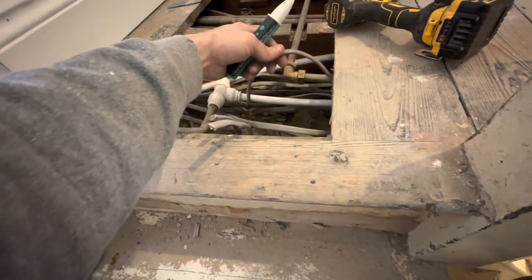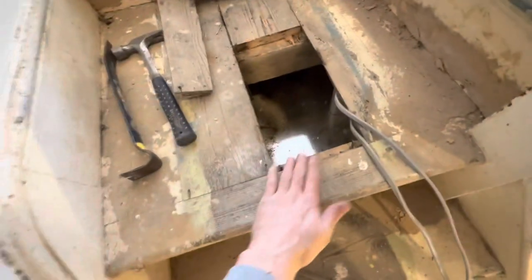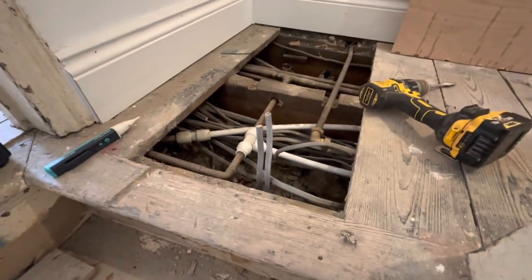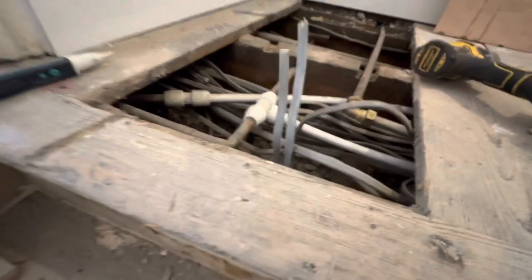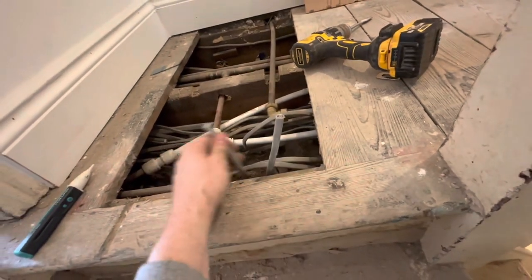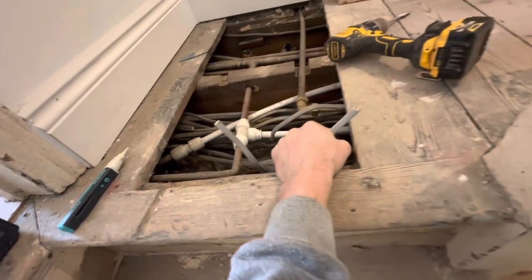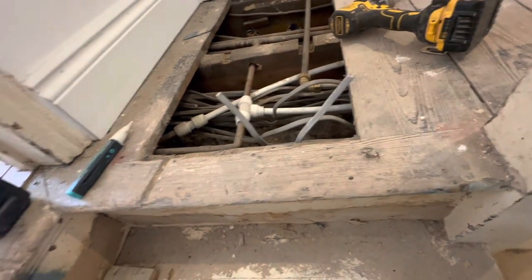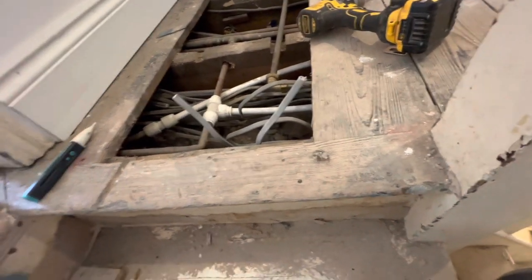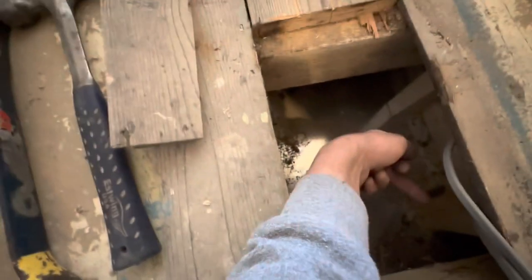That one's live — that is the lighting circuit I believe, so we will need to find that at some point for the kitchen. So I've brought these cables up. Managed to drill on a little angle from the top of the landing here. Took this one board out — these two boards here are already loose. Managed to come up here and blast those two cables. I'm going to put these into some Wago boxes, split that ring there, put two of the grey Wago boxes in underneath the floor here, and then I'll mark the board to say there's a junction box under there feeding the Saniflo, just for future reference. We're going to be putting a light somewhere about here and then a pull cord probably down here somewhere.